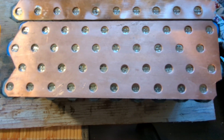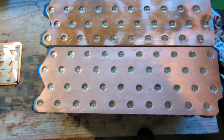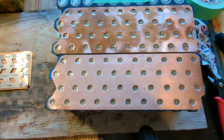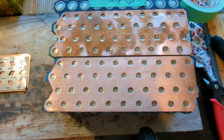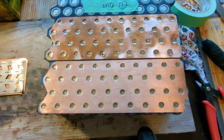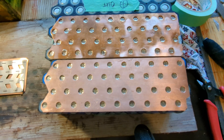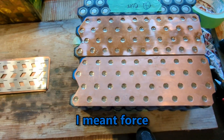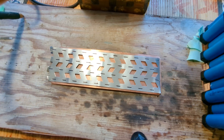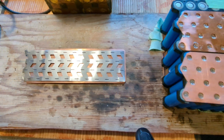Unfortunately I can't be 100% sure that the solders don't let go, because from all the experiments I've had with the nickel strip, it seems that the solder sticks to the nickel surface coating — I don't know if it's electroplated or powder coated. It doesn't take a lot of pressure to remove it from the copper. It seems that the nickel stays with the solder and you're left with bare steel underneath.